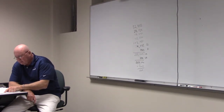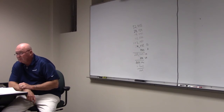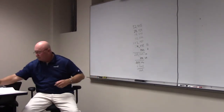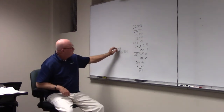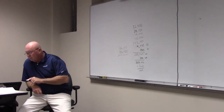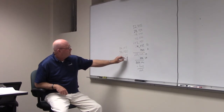Okay. Calculate the appliances and the dishwashers you see there, we've got to do all those. There's 30 units, 1,250 VA, 37,500. The disposal's 864 times 30. The range is 7,500. Again, why are we doing 7,500? Because we're doing what on optional? Nameplate. Air conditioner's 3,600. All of that together is 396,420. And what was our first number for lighting and small appliance, 156,150? We add those numbers together, 552, what? 570. 570, okay.